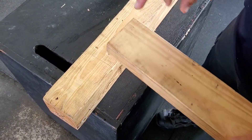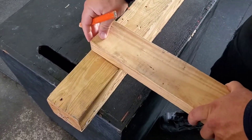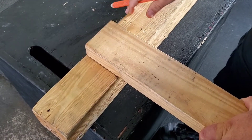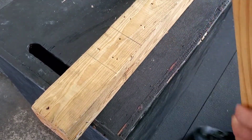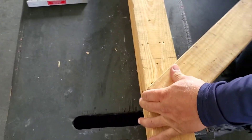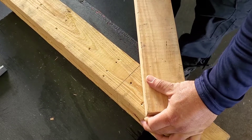So 3.5x3.5, 3.5x1.5, 2x4. The first thing we're going to do is line this up on the 4x4 and draw a line. Then the width, 3.5, I'm going to draw another line on the other side of it. Then I'm going to take the two corners and connect them with the 2x4.